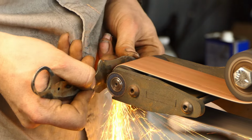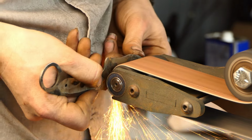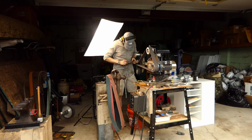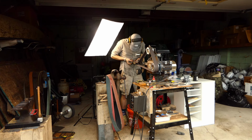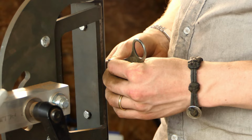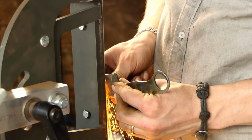The reason that you carve a fuller in before bevels is so that if you have any sort of discrepancy in the outline of your fuller, when you carve bevels, this will actually bring that border back. You use this as a tool to fine-tune the shape of the overall grind. This is something that Matt Stagmer once said that is especially important on swords and larger projects.